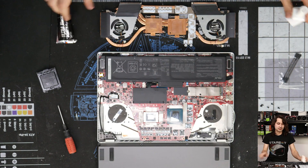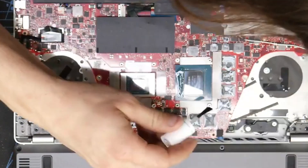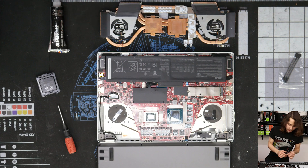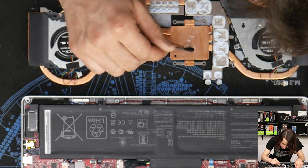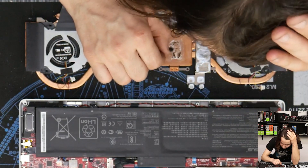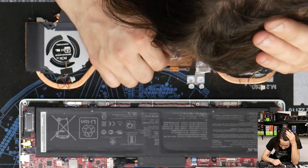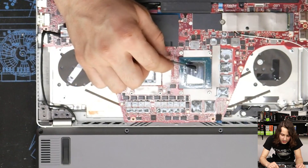Let's go ahead and isolate the rest of this. I'm just using nail polish to cover all this up — that seems like sufficient coverage. Now I'll start applying liquid metal to the copper side. Liquid metal is kind of weird in that it doesn't actually like to stick to anything the first time. You have to just start spreading it around hoping that it sticks. A little bit of liquid metal goes a very long way. It's like it etches through the top layer of oxidation on the copper before it starts to stick. The goal is to use as little liquid metal as possible.